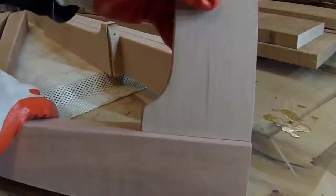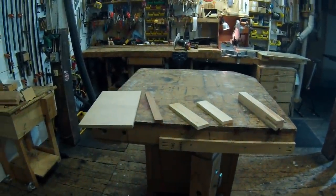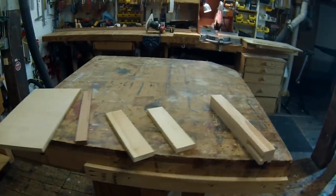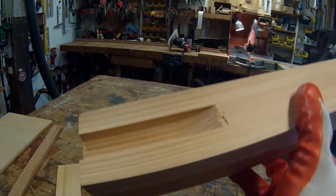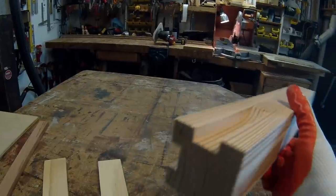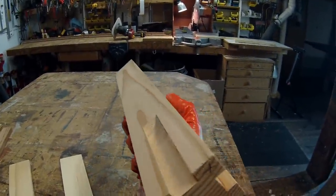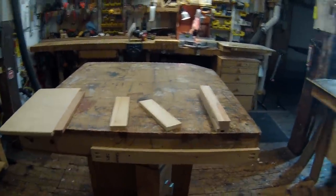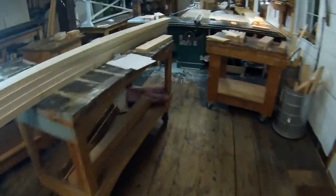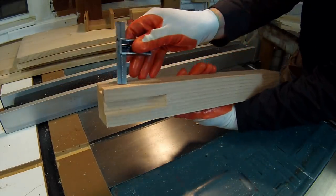Here are the materials to make the jig. I already made these mortises using a six-inch dado blade — dado blades come in two sizes, six inch and eight inch. My previous jig was for eight inch and this one is going to be for six inch, with some improvements. You need a piece of three-quarter inch plywood, a hardwood stick planed to the exact same thickness as the plywood, and a couple of scrap blocks for setup.